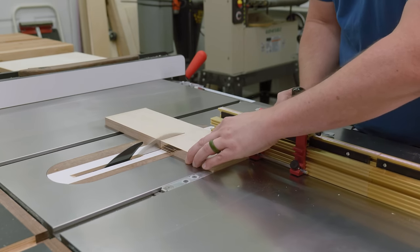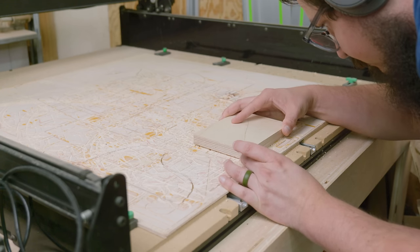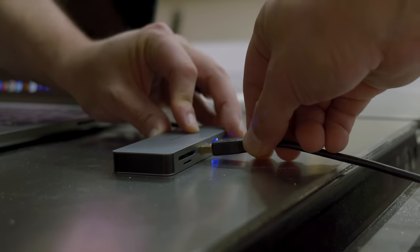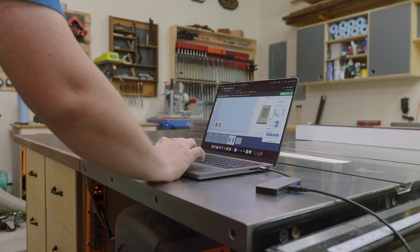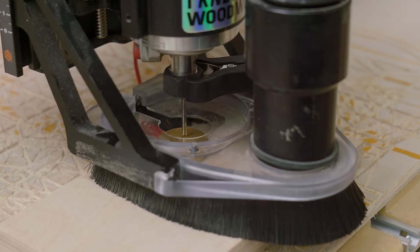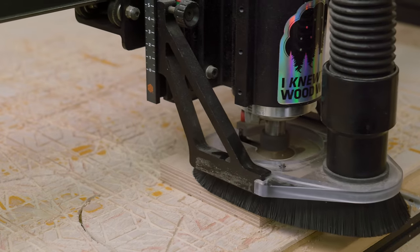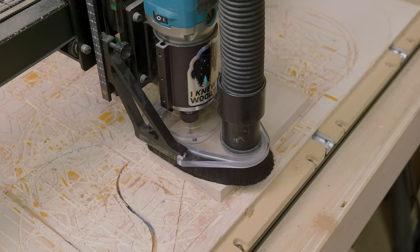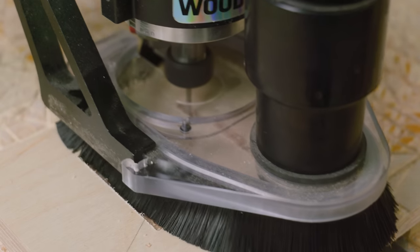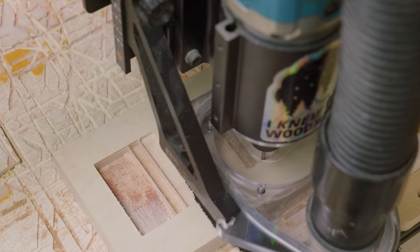Here all I'm doing is roughing out a small block, and then I'm going to take that block over to my CNC and attach it to my waste board, which has seen better days. From there I can initialize my file for my carve and start trimming out my new block. The goal for this block is to consolidate that registration jig. I created a couple steps to make my registration stops for my bevel, and I was able to add a third angle without sacrificing any extra space. This block will register for 25, 30, and 35 degrees.